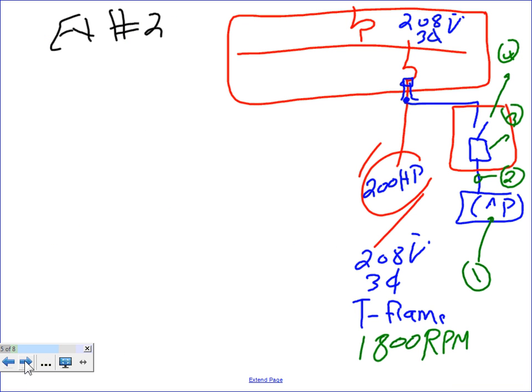Okay, let's take one more example. If you look at page 196 for the same capacitor that we sized, they're specifying a number 2 conductor and a 100 amp fuse and a switch. I'm sorry, 90, where am I here? For 480, they're specifying a number 2 conductor, a 125 amp fuse, and a disconnect to 200.